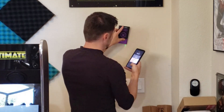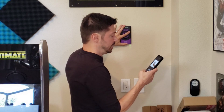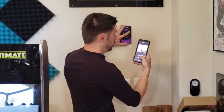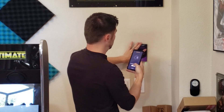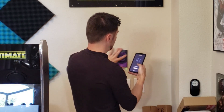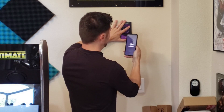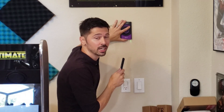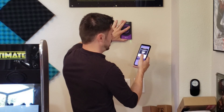We're connected, so let's go ahead and test it out. Hit done, then calibrate. Make sure your phone is within three feet of the device and there's no wireless interference like a wireless router or microwave. Hit next and start calibration, going counterclockwise. Calibration is completed. This device does not do plaster walls — only drywall, so keep that in mind. Hit images and start to scan.